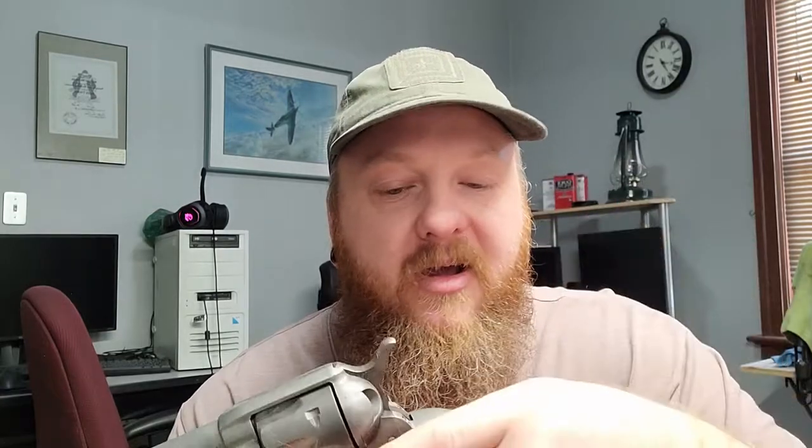After the vinegar bath I used about 600 or 500 grit on the handles and made it as smooth as I could, going up to about 800 grit. I wanted it smooth, but not so smooth that if my hands are greasy the gun just slips out. That's partly why I added some burn marks with the torch — it gives a little bit of grip texture, which I might also do to the other one.